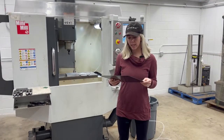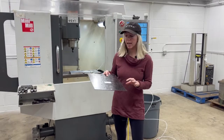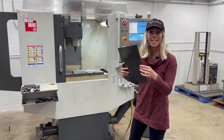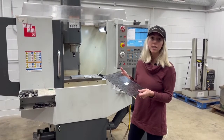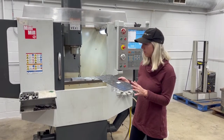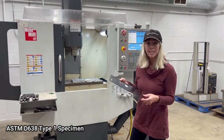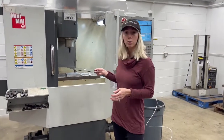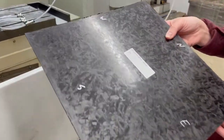Today at Frank Bacon, we have a customer that needed us to test carbon fiber material. They provided the material in sheet form, which we're unable to test directly, so we had to use our Haas machine to create a custom vacuum fixture to produce specimens under D638 Type I. Overnight we created this vacuum to make these specimens so we're able to test the carbon fiber material for our customer.